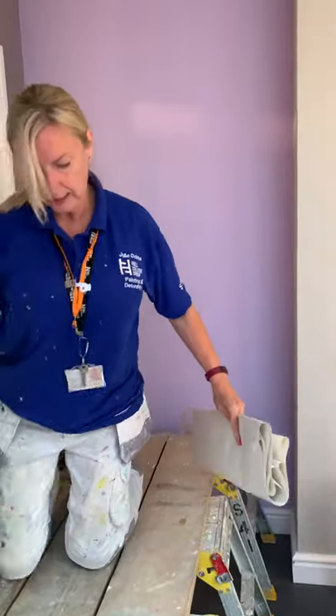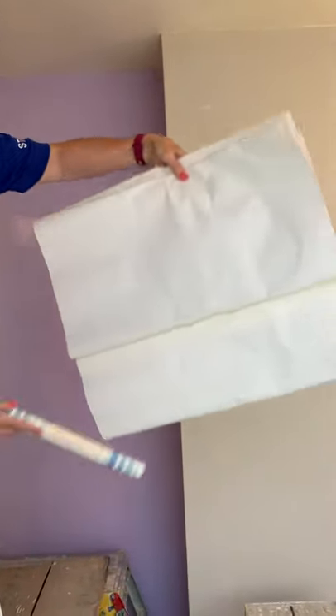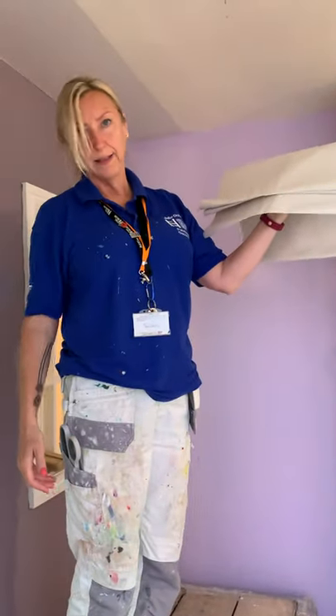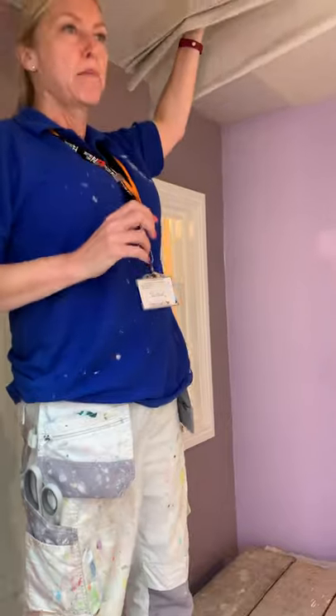I've got my next piece — I'm going to show you how to put them up and the star cut. Put your crutch from down there, all your pieces open at your gap, all your folds on top of the crutch. Every fold is now on the crutch. The reason people struggle with ceilings is they don't keep this arm up in the air.